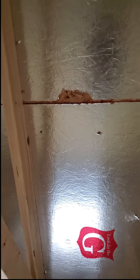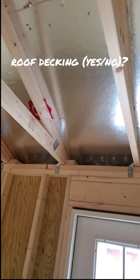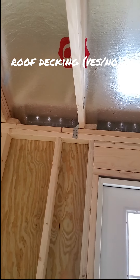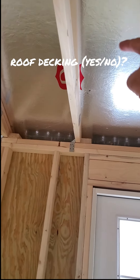Let's take a look at the roof structure itself. This particular building has a radiant barrier applied onto the roof decking. I want you to look for the roof decking that goes all the way across — these are slabs like your plywood slabs for your floor, and then the metal roof is applied on top of that on the outside. A lot of portable building companies don't use roof decking — they just put the metal roof right on top with little strips of wood screwed down. That is a weak roof. You want one that uses decking going all the way across, and then the metal is fastened to that decking. That's super important. Also look at the roof trusses — they need to be two-by-fours. Sometimes people use smaller pieces of wood, which means a weak roof. Don't get that.